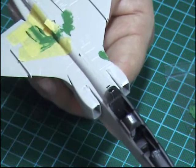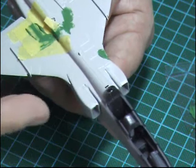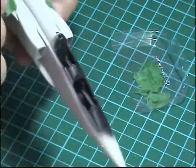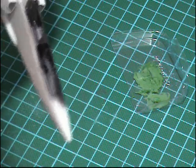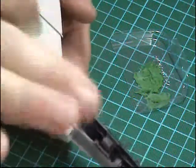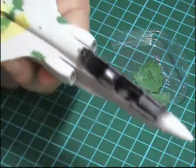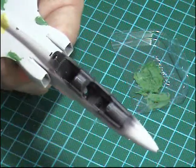So really, the longer you can leave it, the better, because it's easier to sand, and obviously it will shrink back, as we were saying, the shrinkage business. It will shrink back, so certainly you have to allow for that. Otherwise, you're going to sand it back, have it a lovely finish, all looking gorgeous and great, and then before you know it, the next day comes along and there's a little dip where it shrunk back. So I'm going to carry on filling the entire thing, and I'll see you in a minute.